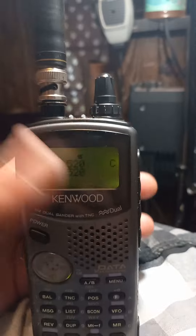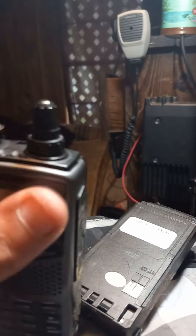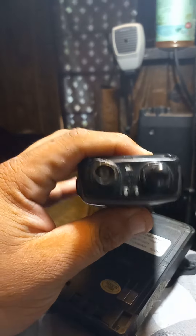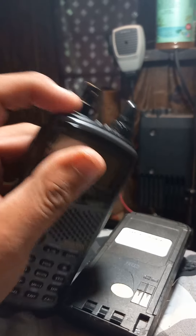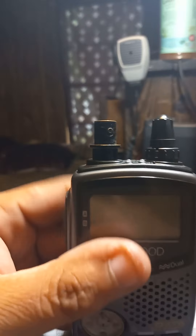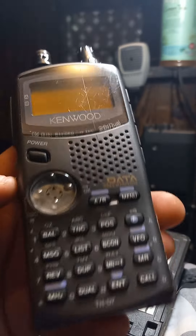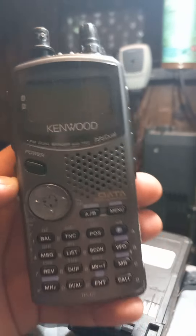I have a basic antenna on it just to have something. A tip I learned from other videos: try to get a BNC to SMA adapter. I didn't know this, but SMA connectors have a lifespan - you can only screw and unscrew them so many times.